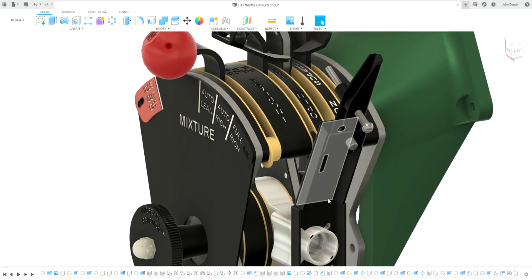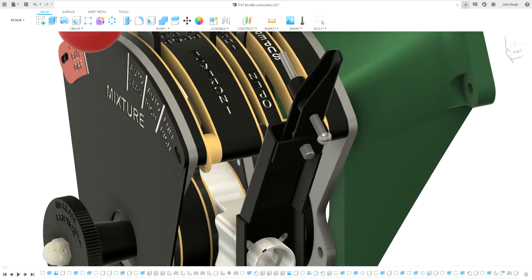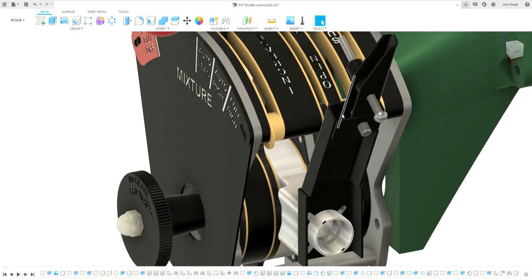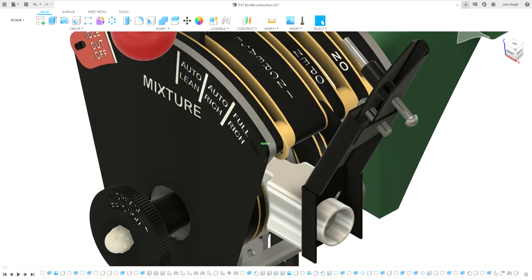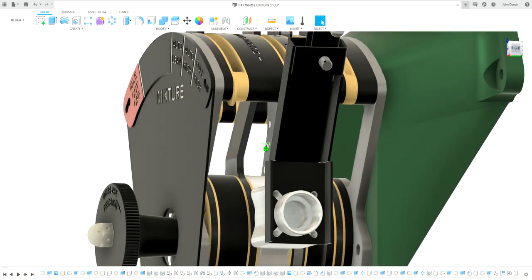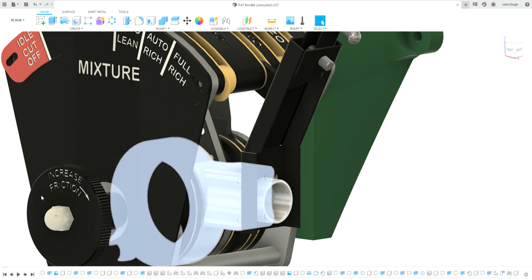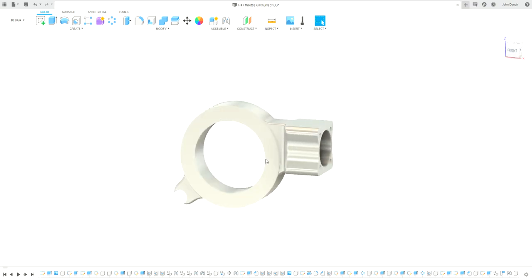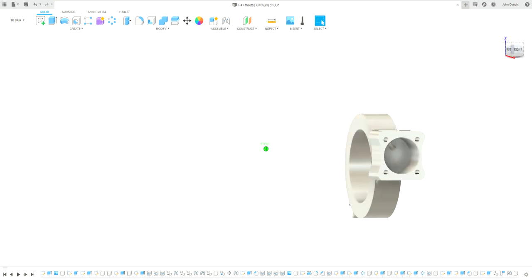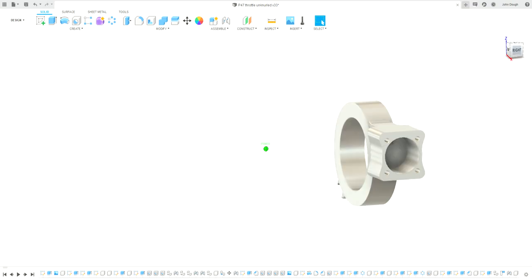Most of the pictures I could find showed early ones had a very complicated aluminium casting, but the only plans I could get were for this rationalized version. I've had to rationalize it a bit more so I can weld and do other bits, making it actually makeable without big press tooling. These parts all free-float on the spigot on the tube and are held by the pin at the back — quite a complicated thing to set up and get machined. I haven't got the aluminium yet, but it'll be a fun CNC job.